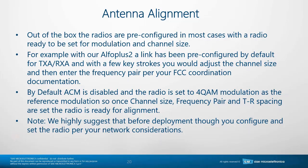So before you hang this radio, make sure the configuration really is what you want. If you don't configure the radio and leave it at default, you need to do the TXA-RXA, which means at least one transmitter in the AP-2. In all other radios, you only have one transmitter, but you need to configure at least the transmit and receive frequencies, power, and sets of modulation.